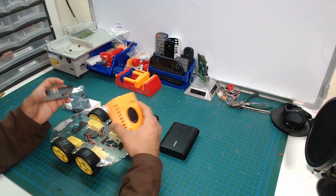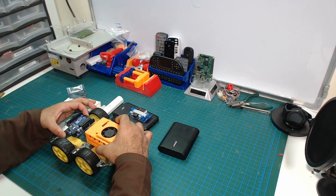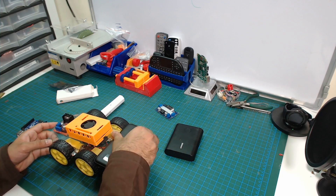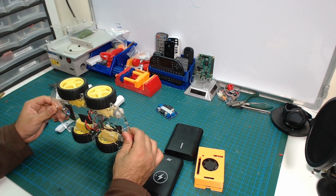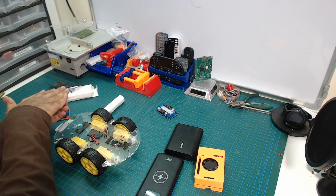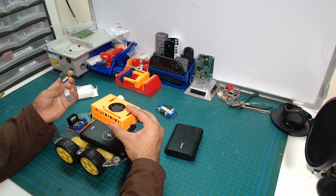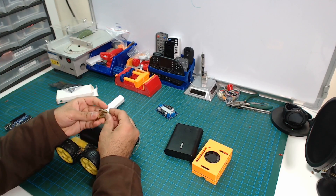Overall, we have to put all of this together in a way that we can add and remove stuff. The problem is that this chassis is only single-layered and it will be very hard to fit just the essential parts alone. If we put the Pi, the H-bridge, and the battery, it becomes quite a mess. So I'm going to create another plate — since I don't have acrylic right now I will use 3D printing — and create a second layer on top. In the bottom layer we could have electronics not used frequently, and on top we could have the Pi, camera, and Arduino. We can use spacers for this.